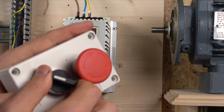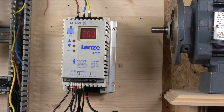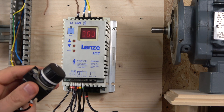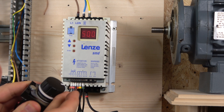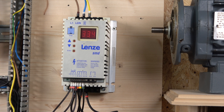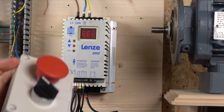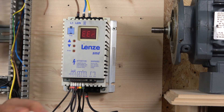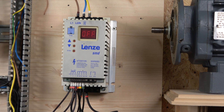Now that we've done that, by pushing the selector switch forward, the system is live and you can control your speed with the potentiometer. It's quite straightforward. Let's also demonstrate the e-stop — it's a great way to stop the drive. I do suggest using this method when wiring two-wire control. It completely kills the drive and afterwards the drive is reset and ready to go again.